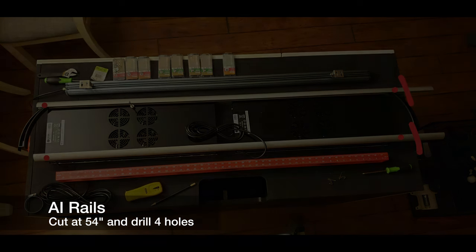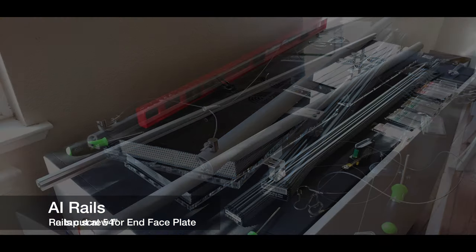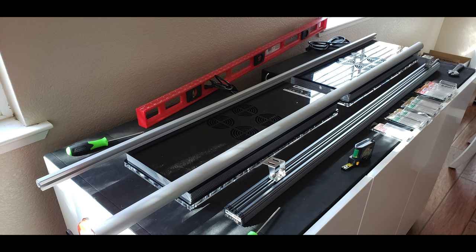The other thing I did was have him re-tap the two ends that were cut, so I can put the original screws back in should I decide to add a faceplate. I had the bars cut at 54 inches — not 59 or 60 — because that was the perfect length aesthetically. With one-inch holes drilled on each end, the holes ended up about 52 inches apart, which matched the stud positions in my ceiling.